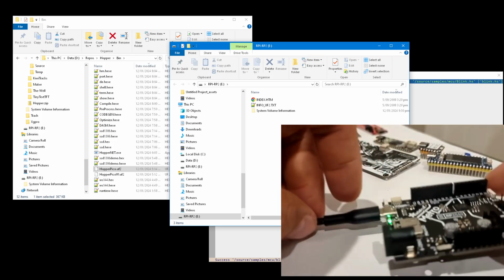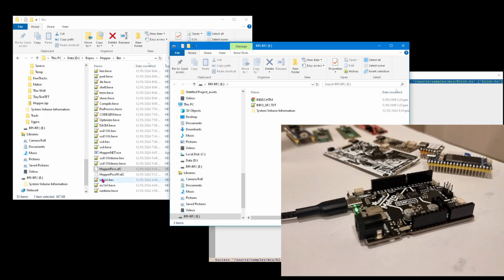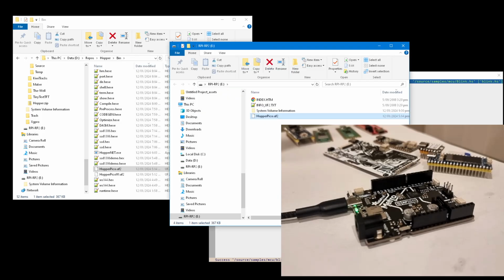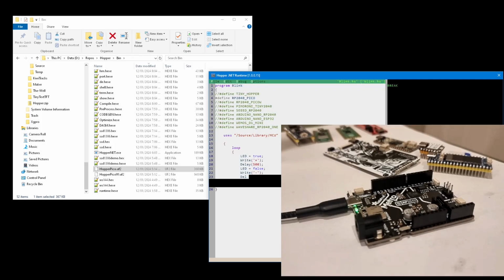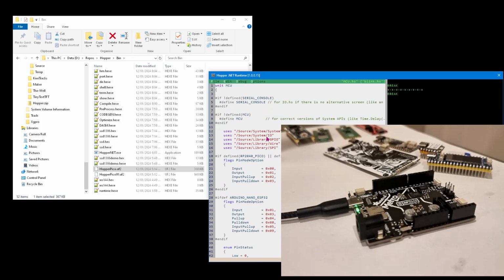Okay, so we've got it powered up. Let's treat it like a Pi Pico because it doesn't have Wi-Fi. And then we'll load this and run it. And now nothing happens. We're getting the serial port communication, but we're not getting a flashing light, right? So earlier I saw this and I wondered, what if they are trying to emulate Arduino boards precisely?